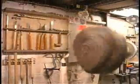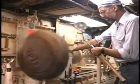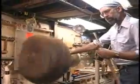What I often do is just put my hand on the lathe and sort of feel it. Then I'll bring the speed up until I feel it kind of start to rock a little bit, and I know I'm starting to get some vibration. Then we'll just stop there.